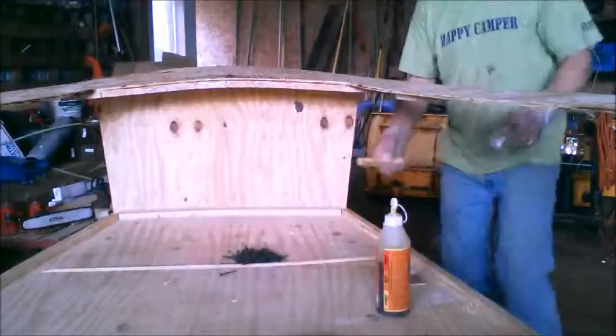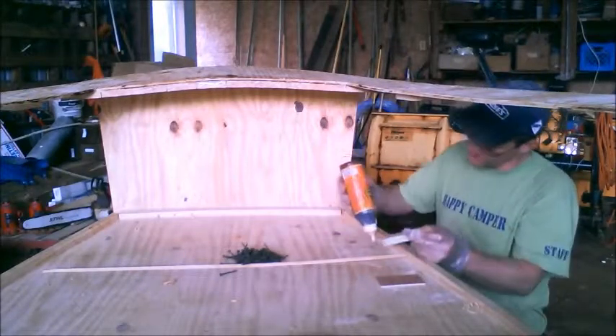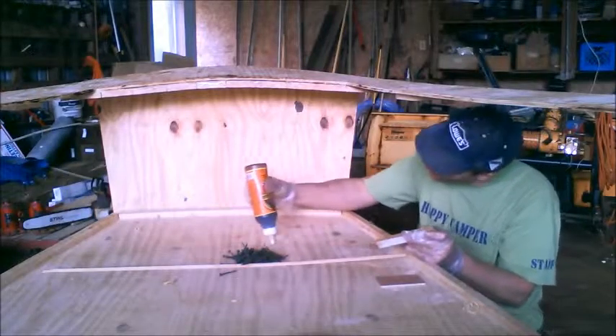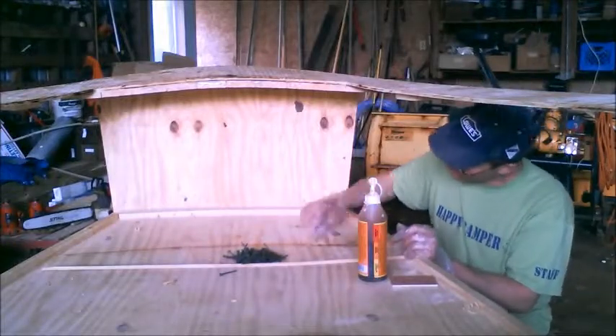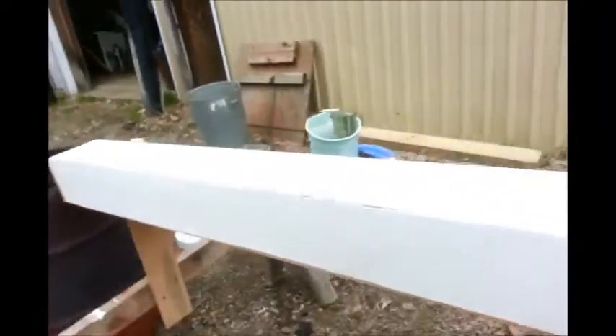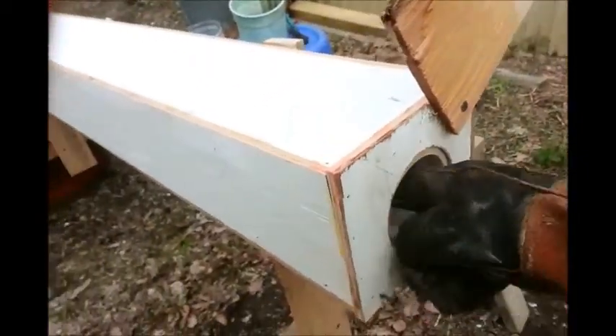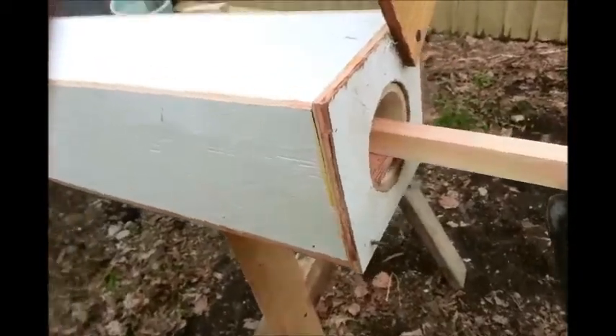We got that stringer in. Like we did last time, we're getting everything prepped before we pull that out of the steamer. I'm going to spread the glue on this half, then pull it out. The fire is still going. You can see some steam coming out of there. Those pieces were in there just to keep it up off the bottom so the steam can get to all sides of it. We'll come back and pull that out after we get this in place.